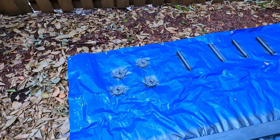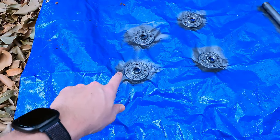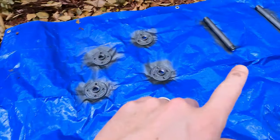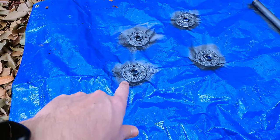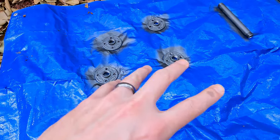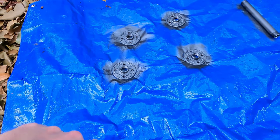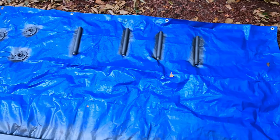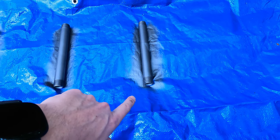These pieces here are the portions that will attach to the two-by-four, and then I simply screw in the other pipes. These are called floor flanges. I'm using all three-quarter inch pipe components. I'm going to use four of those to have four posts, and these pipes are 10 inches long.